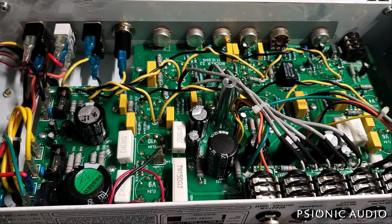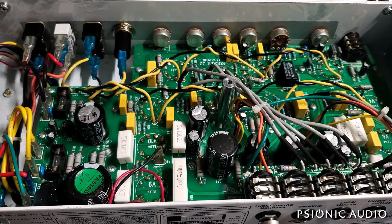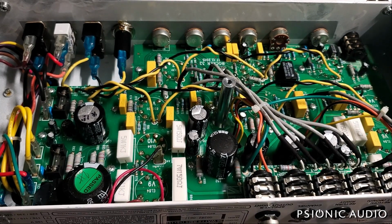And I'm taking out a standby. I've got a current limiter on to see if there's any condition that would cause a fuse to blow. Now that does not necessarily mean that this HT fuse will not blow again, but let's find out. Oh yeah, it's glowing real bright. Turn that off. So at this point, the most likely cause is a bad output tube.